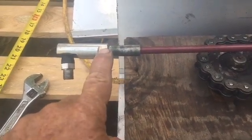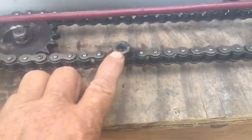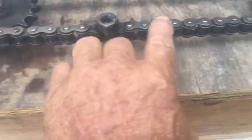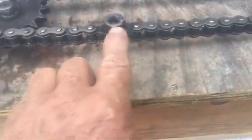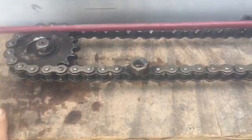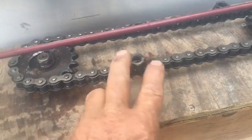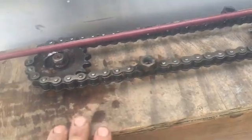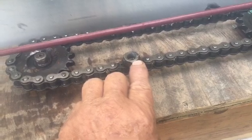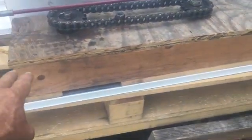It's a half-inch 20 thread here, and we welded half-inch 20 thread nuts onto the main link — just right there, ground those two down and tacked one there. I was going to the trade show so I tacked one on the other side in case one came off. They do make attachment links — I just didn't have the time to find them, but welding the nuts on works just fine.